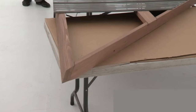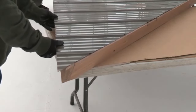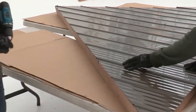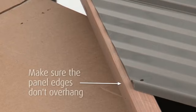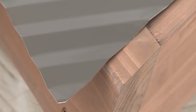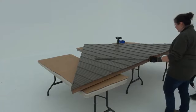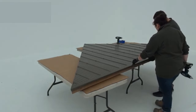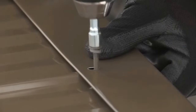Take care not to over tighten the roofing screws. Place the short right panel onto the roof rafter assembly so that a rib overlaps the long panel right. It should be flush to the edge of the rafter corner right and overhang slightly at the bottom. Repeat to install the short panel left. It's okay if the panel edges aren't quite flush with the rafter corner left or right — just make sure they don't overhang. If they do, loosen the roofing screws at the top of the assembly and remove the other three. Adjust the roof panels so they are aligned correctly, then replace the roofing screws and tighten. Get some assistance to position a roof edge left 72.2 and roof edge right 72.2 along the bottom of each small roof panel assembly. Make sure the ends meet tight in the center and the other sits flush with the outer edge of the fascia beam assembly. Attach with roofing screws.